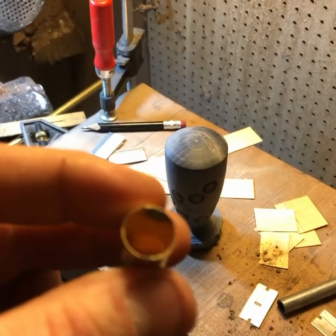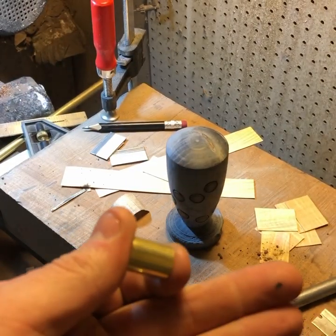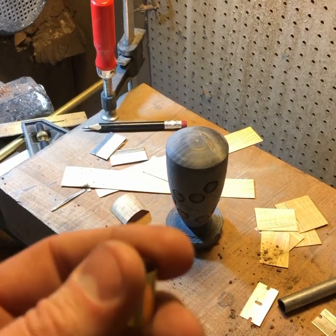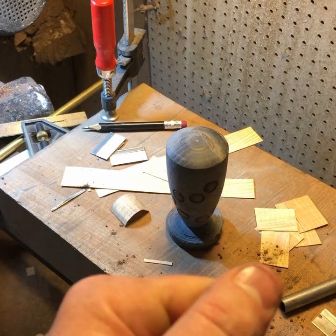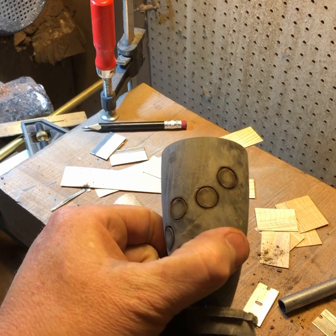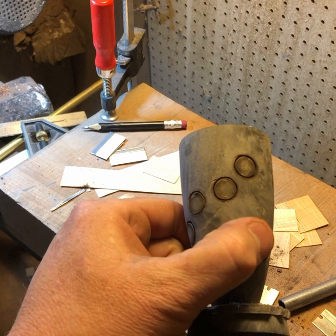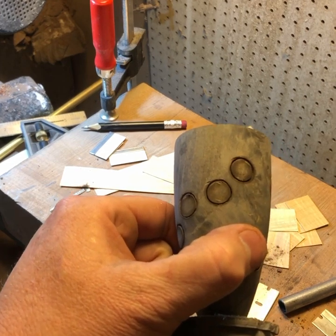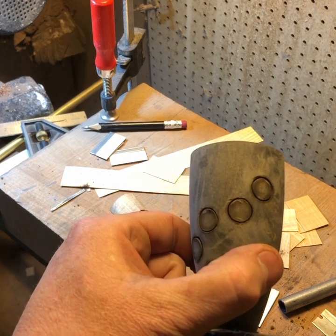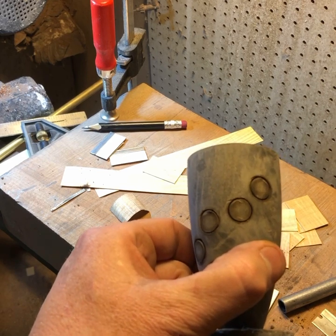Okay. And the reason why I'm going with this method is because I actually tried wetting the veneer, with steam and with just regular water. The issue you run into there is that the hole cut in here is so close to the thickness of the veneer that once you get the veneer wet, it swells up and no longer fits in the hole. And you can go with a thicker walled hole saw, but then you run into a couple of other issues. If you wet your veneer and put it in there, you can't really put your glue in there.